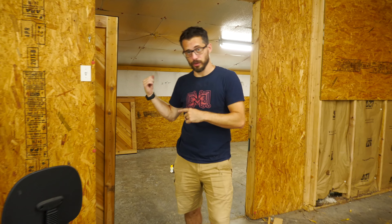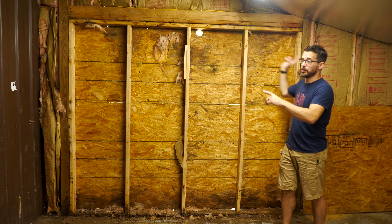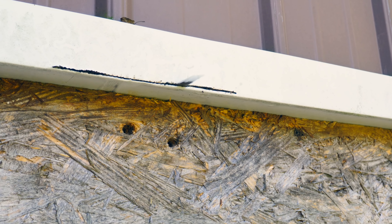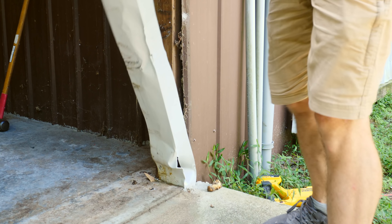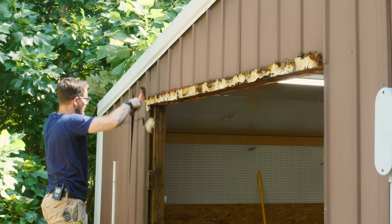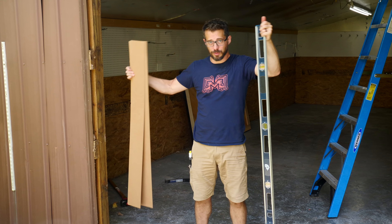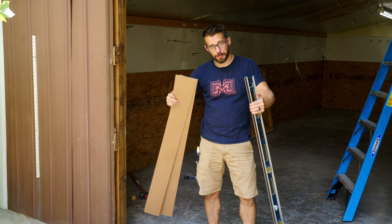The barn has a large room and then a side room, and that's where these doors are going to go. There's a lot of room over here, but unfortunately we can't get anything in and out because of this wall. It's a 2x4 framed wall with OSB on it, nailed into the outside frame, so we're going to cut those nails and push this wall out. We've got the opening ready except for the huge number of ants still walking around — we'll deal with those later. We're going to put the doors in and drive in screws into these 4x4s, using a level on the outside edge and laying down some 1/8-inch scraps to set the doors on so they don't drag.